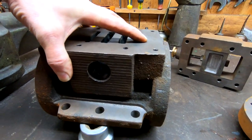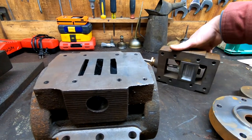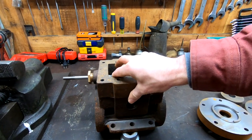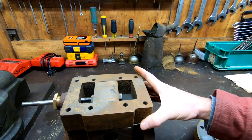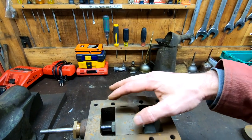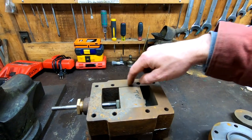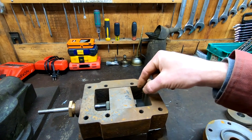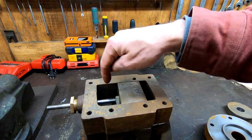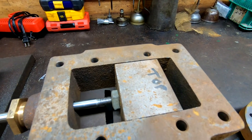So just a little prop here to hold that up. The valve assembly simply bolts on the cylinder casting here, and it is missing a head — we have to put some sort of a valve steam chest cover here where the steam would be able to go in. This area is called the steam chest; it's full of steam at all times. And this valve is what controls the admission of steam through that port down into one end of the cylinder.